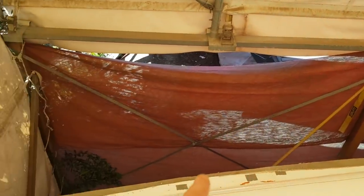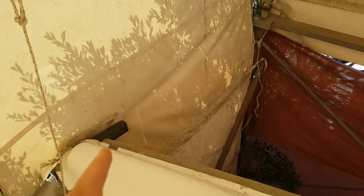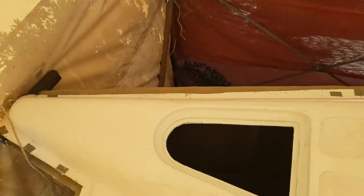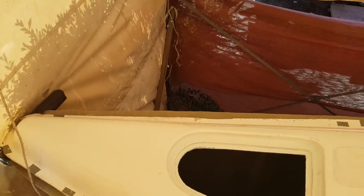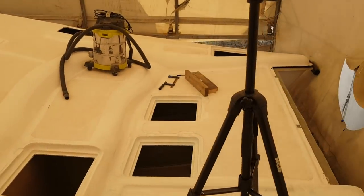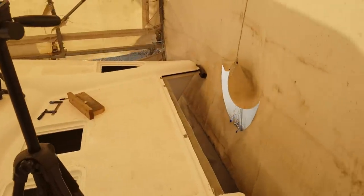What I'm talking about here is the way the whole side comes down here like this. When it reaches here it's around about 20 millimeters inboard of where the hull is, and it's not because I put bulkheads in or anything - it's purely because this nose I don't think ever fit the hull perfectly. This is the quandary with old moulds and older design boats. They were handmade, not with CNC, and this is the beauty of the new CNC things - they can almost make them fit perfectly.